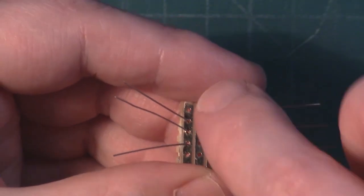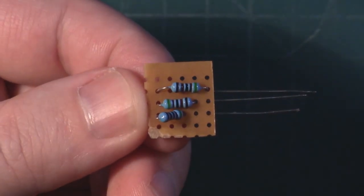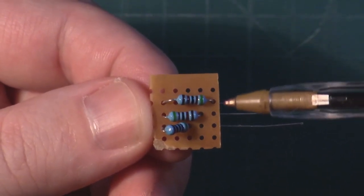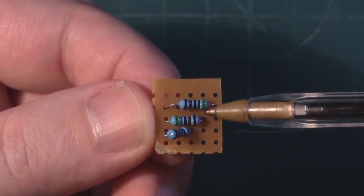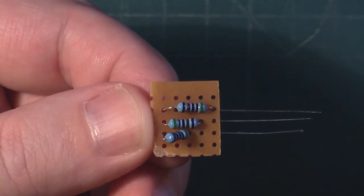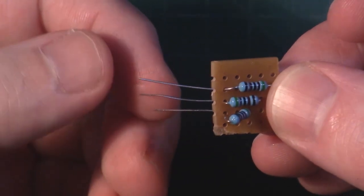So I have some 5.1k ohm resistors. I don't have 5.6. I could make it up perhaps using two resistors, but for neatness's sake I'm just going to go with 5.1, kind of approximate it. Again, this is a compromise, it's always going to be something that happens,